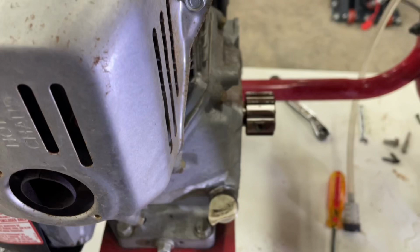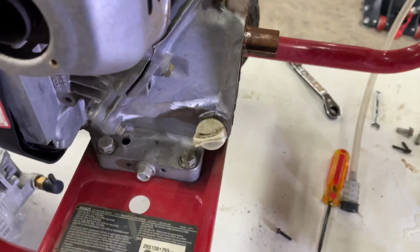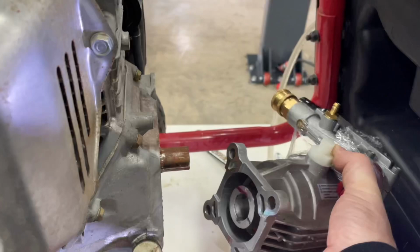The next thing I did is I took a look at this gear and I pulled out the set screw. I'm gonna pull this guy off. One of the things I'm lucky at is that it came with this kit a set of replacement screws. So I will be putting new screws in, but looking at this, this isn't just gonna bolt right on here. I mean, it will, but the key is I got a keyway there and a keyway there, but I have a key. So the part is in the kit. They provide you a key.